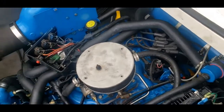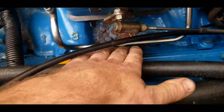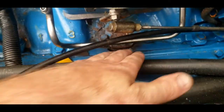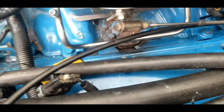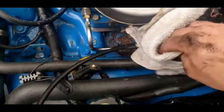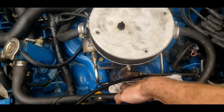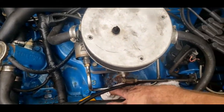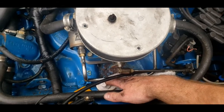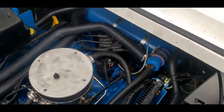We believe now it's a wiring issue. Here I was getting ready to explain that it's an intake leak and you can hear it — which you can — but it's actually an exhaust leak. That exhaust crossover is designed to heat up the throttle body, and that's what's blown out. So yeah, that was the wrong information — that's not an intake leak, that's an exhaust leak.